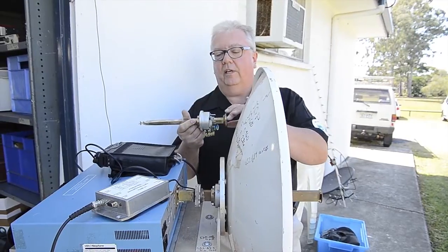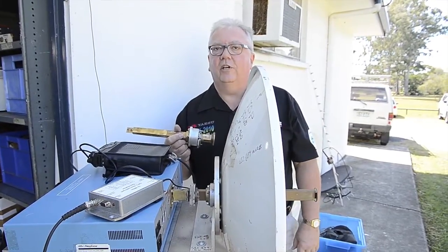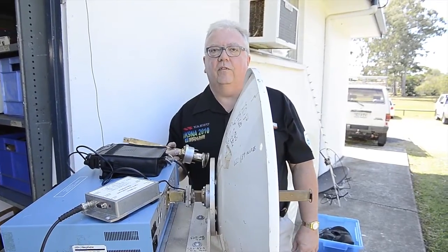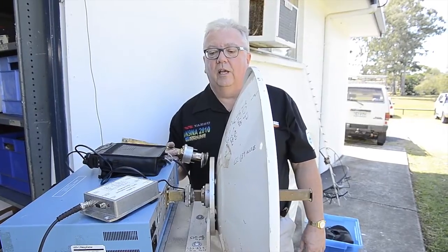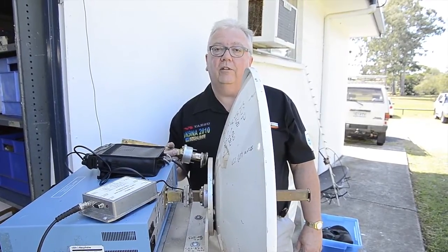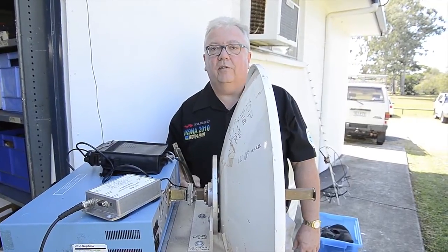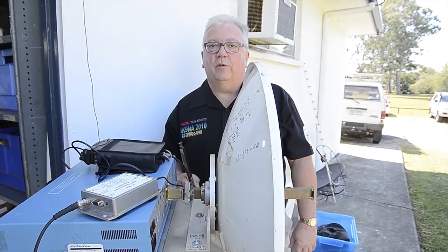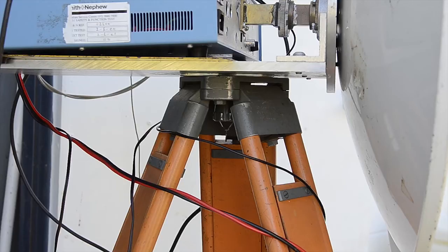The feeds can just be interchanged and slot in — it takes five seconds to change one feed for another. I have another feed made up for 5.7 GHz which just fits into the same interference hole in the middle of the dish, so again it's very easy. It's all mounted on just a piece of alloy plate with a hole milled inside that matches the thread on a theodolite tripod, so it all goes together with a thumb nut underneath.